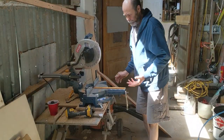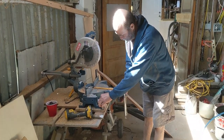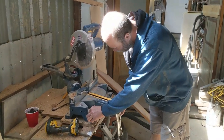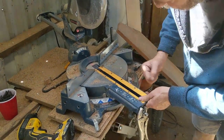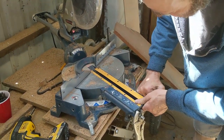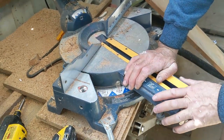For the roof, for the slope of the roof, I just have my saw here. I'm gonna go like 22 and a half degrees — I like to go 22 and a half, 45, all that stuff. I just tighten up my miter saw in position.